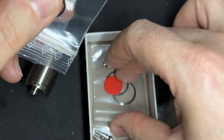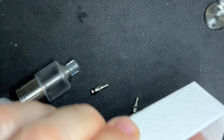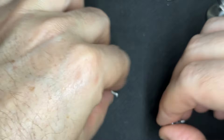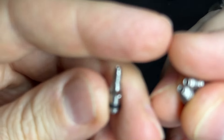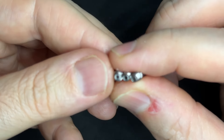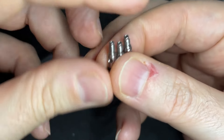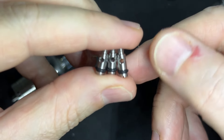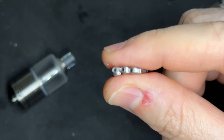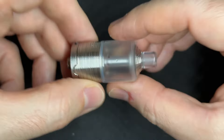These were coming from the extra reducers. One airpin is installed and these are the other three. One point I want to mention right away: there is no marking indicating which airpin is which, and they are 1.2, 1.3, 1.4, and 1.5mm. So it is not easy to identify them by eyesight. I would like to have a small marking somewhere, even just a stripe or a few dots, because it is not easy to identify them. I just had to take a tool to check out which one is which.